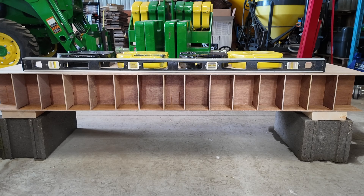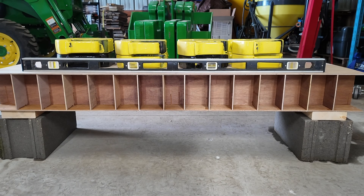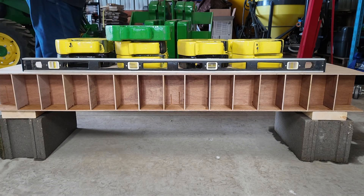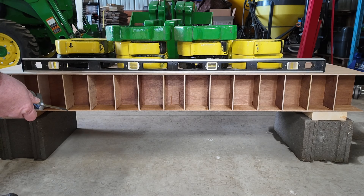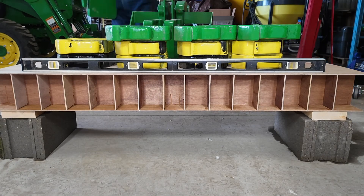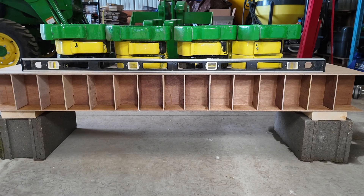At 160 pounds, visually I don't see any deflection — the feeler gauge shows nothing changed. At about 320 pounds — eight of the 40-pound weights — we've increased a little bit, still on the order of a hundredth of an inch. I can actually hear the box cracking a little bit. I can just barely slip a 0.035 inch feeler gauge between the level and the surface, so 35 thousandths of an inch deflection at 460 pounds. At 600 pounds, the deflection is still in the vicinity of three hundredths of an inch — still in feeler gauge territory, well short of something I could measure with a ruler.